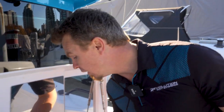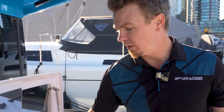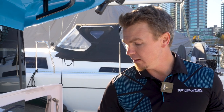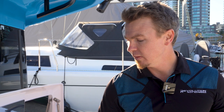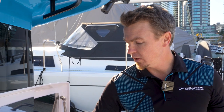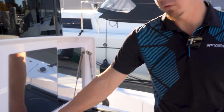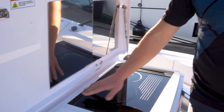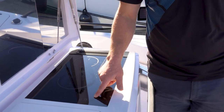I'm going to put it in and out of locked mode right now just so you can see how that works. It's a press and hold for about five seconds — you'll hear a long beep. If you see the LED indicator lit up by the lock symbol, you know it's locked. To unlock it, it's simply the reverse: press and hold for a solid five seconds. It'll do that long beep again, and when that's gone you can see only the standby light, meaning you're ready to interact with the buttons.